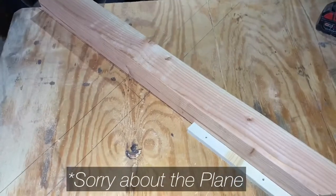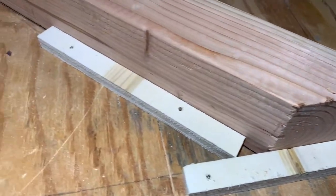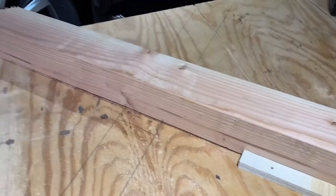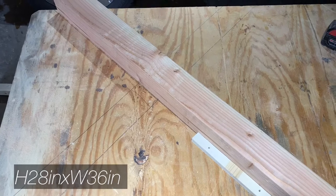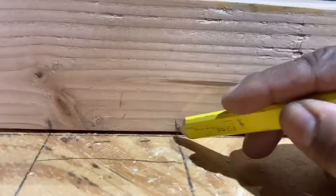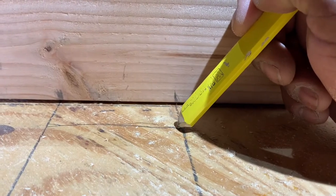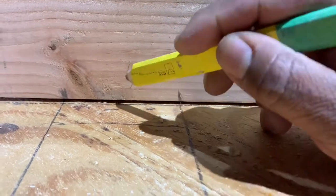I put some scrap pieces here to help me have a placement guide for my leg, so I can place each leg in the same position every single time and not worry about it being too far, too low, or too high. I also drew on top of my workbench so I can match up the legs and see where the cross section is. I still measure out the distance between pieces, but this helps me find center and makes it a little easier.